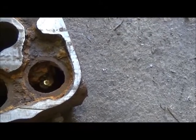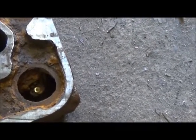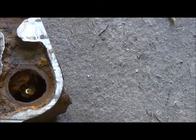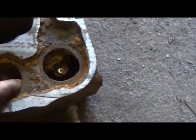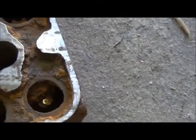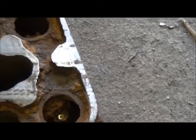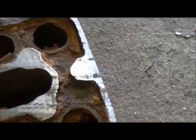We're not going to quit — we're still going to machine this off. We're still going to have enough surface here. There'll be enough to get this level and get it where there's a gasket on it, as long as we don't get too far into the cylinders. They're a little quite a ways down, so I think we're still going to be okay.